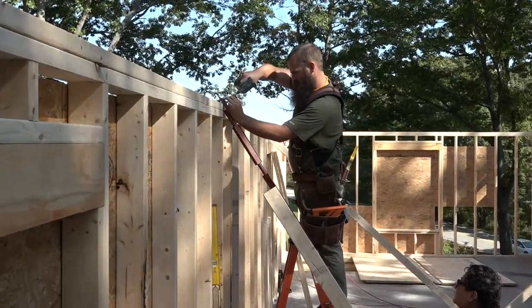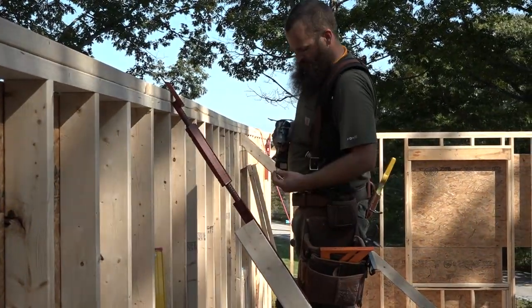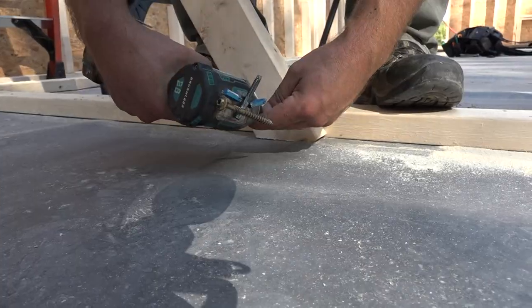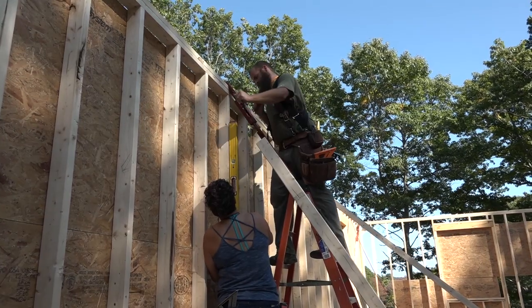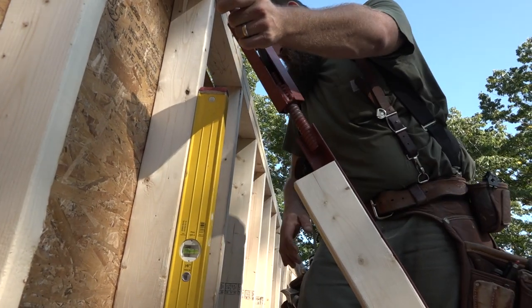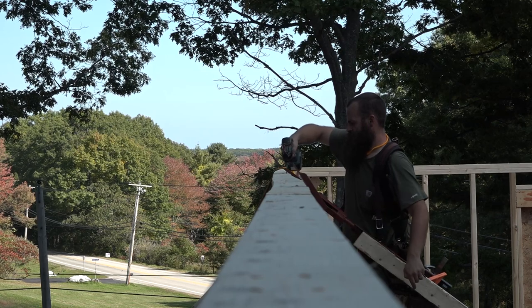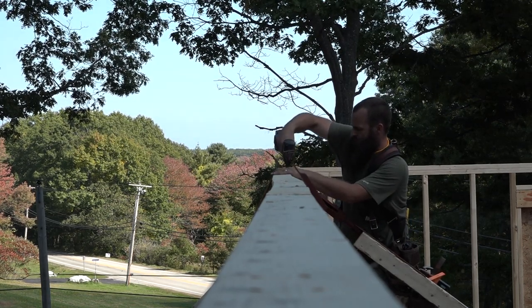With the corners exactly where they need to be, Ben and Liz go about straightening the top of the wall. They add a few braces to the particular parts of the walls with big humps and wumps, slowly bringing the humpy-wumpy wall into alignment with the string line. Ben screws down into the top plate before cranking on the brace.